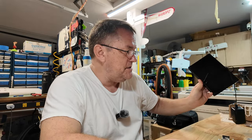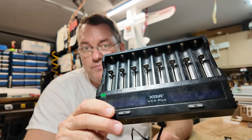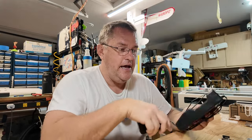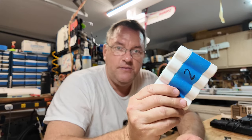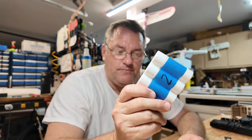In terms of charging, this is an Amazon special that I've been using — I carry it in my bag. I like it because it flat packs. It does charge slow; I charge at about 500 milliamp hours per battery. This charger displays cell impedance as well as total milliamp hours returned to the battery. During the charge you can keep an eye on the temperature — just put your hand on it, make sure everything's good. It's a slow charge compared to jamming power into a lithium polymer cell, but for the benefit of stability, safety in transport, and the fact that you can replace an individual cell versus throwing out the entire pack, I think the lithium-ion battery solution is something you may want to consider.